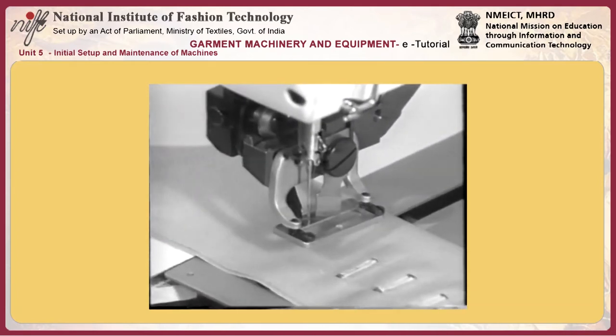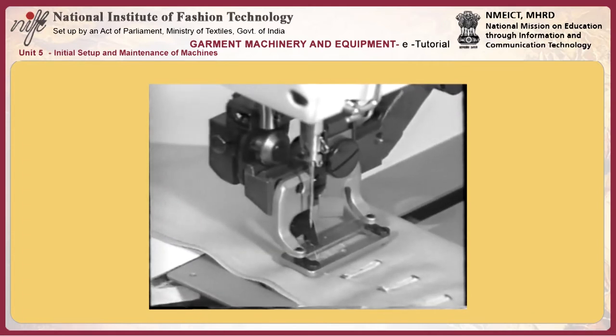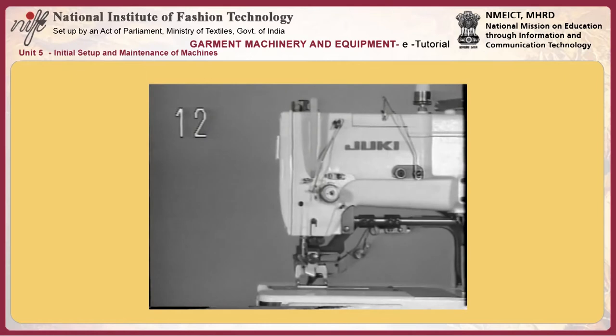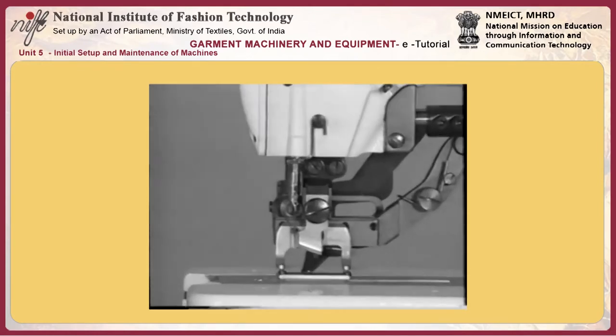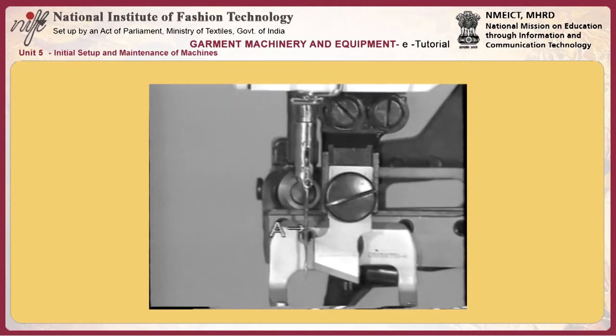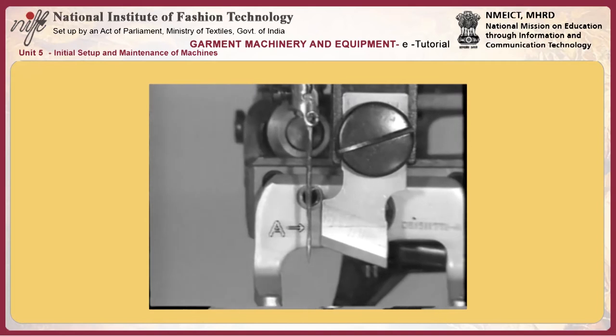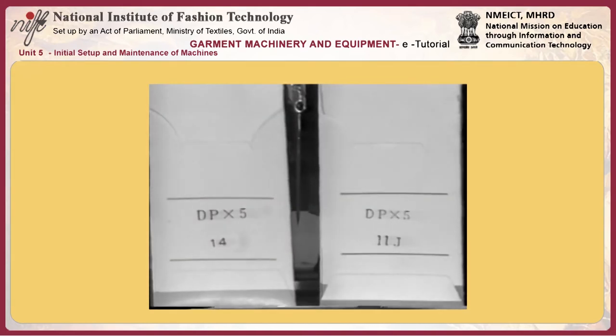Operation to be taken when the knife's dropping action is not necessary. In such a case where the bobbin has run out of thread, the knife can drop if the machine enters the stop motion state without trimming the needle thread. Since the knife is designed to drop the material, re-sewing will become difficult. In this case, keep lever A held slightly pressed down to prevent the knife from dropping.